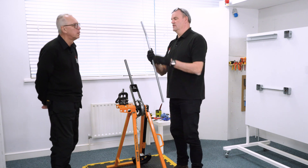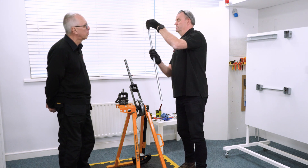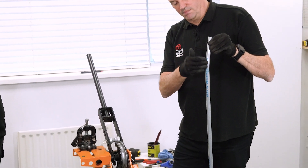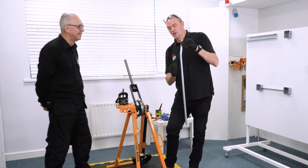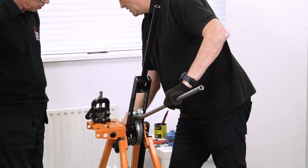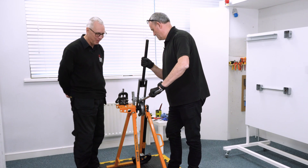Remove the piece — as you can see, there's the little kick. If you've got the actual accessory there, we want it to go inwards because we're going in, so we come down, little kick, and then we're going to bend it back. The thing I need to do now is make this piece parallel with the new piece. Now when I put this into the bending machine, let's get the stop back up — can you see anything that may go wrong here?